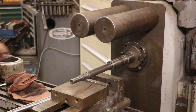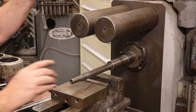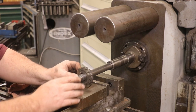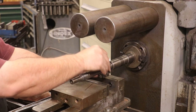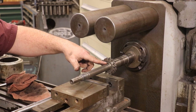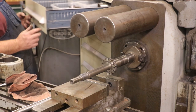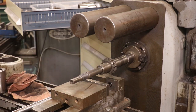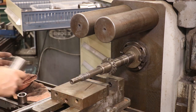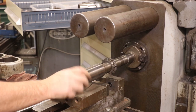Next thing I want to do is build my arbor up. I've got my one inch arbor in here — it's already got some spacers on the back. I want to go ahead and put my cutter in here — I want to be cutting in a clockwise direction. There is a keyway over here that drives that, so I'll line that up and then get some spacers and put them down here to the end as well as our bearing blocks. I've got my spacers on and now I'll put the bearing and the nut to tighten it all up on the end.